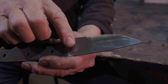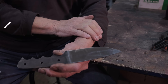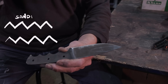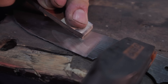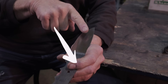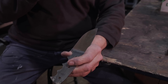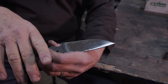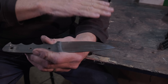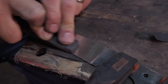If you look closely, you might be able to see the grinding lines — it's a bit like a ploughed field, all your grooves going like so. If you come and sand over the top with a finer paper, or even a coarser paper going parallel, your paper goes down into those grooves and polishes the sides — that won't give a nice flat finish. You've got to cut across the top of those grooves. First, by going across the top you're cutting off the high spots of the deeper grooves. Your finer paper cuts the tops off the ridges, providing a new flat surface with shallower grooves. The second reason to cut across is that you can see the old marks underneath, so you know when you've got rid of them.